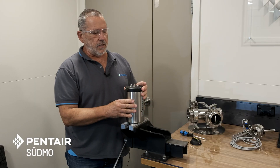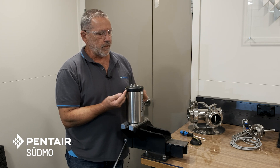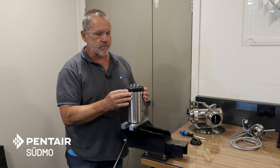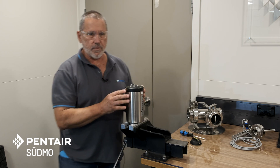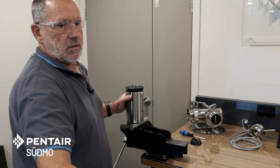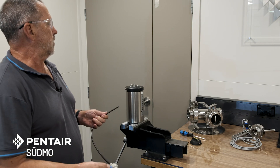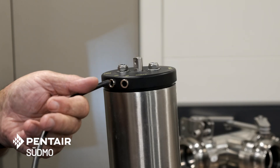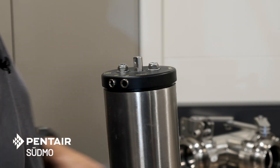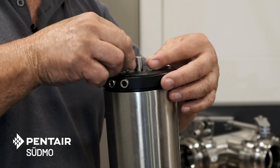We need a little bit of compressed air just to pop this out. Don't plug the air into the support and energize it — there's a very good reason for not doing that. We'll just grab an air hose and give it a little bit of a squirt up the B-port, and you'll see it pop loose. Now we are safe to take the top off.